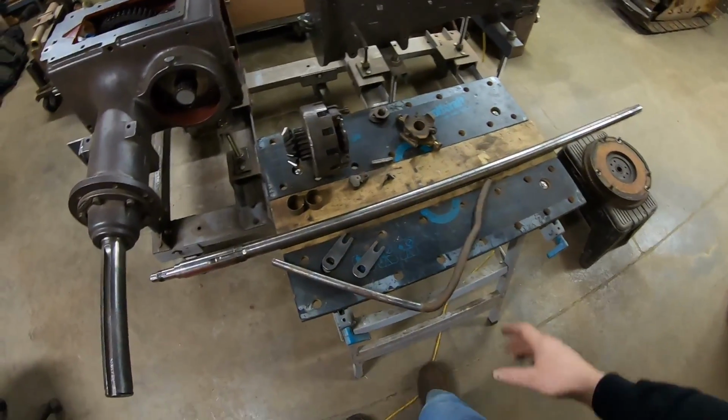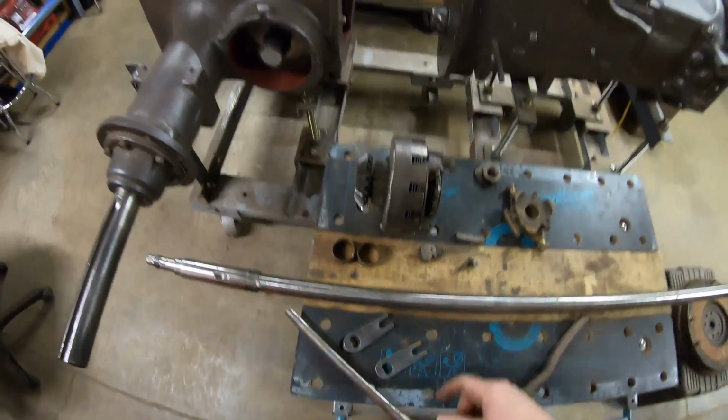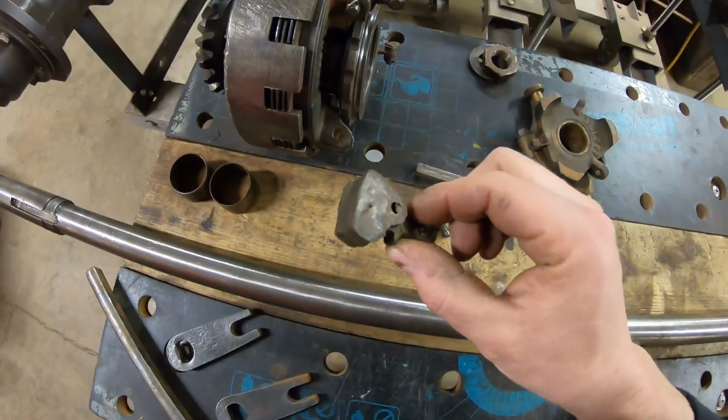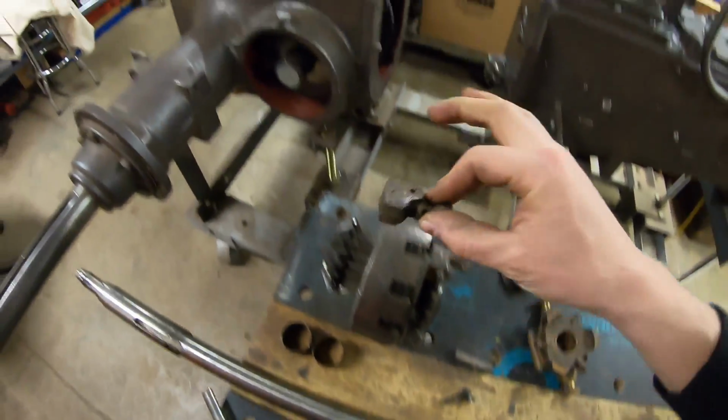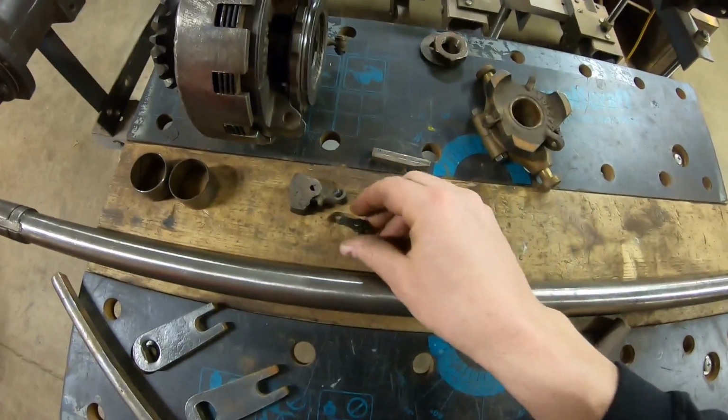And there is a lot of problems. This is the live power PTO clutch. This is the piece that killed X231 back on the farm. This is the one that lost the clutch dog, rattled around, bound the gears, grenaded the whole back end, and you can see we've got ripped and torn links.